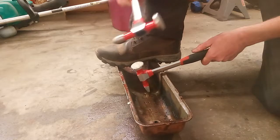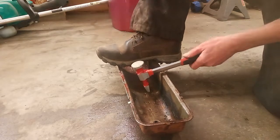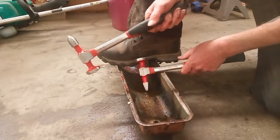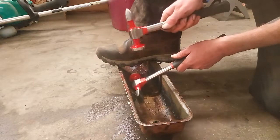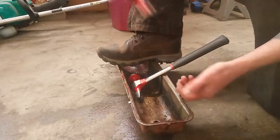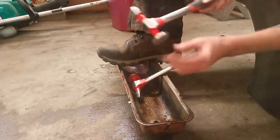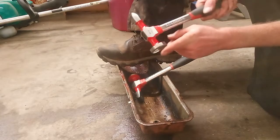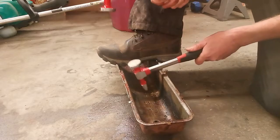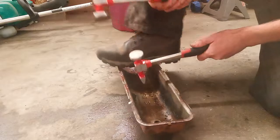Doing quick little taps like that is kind of like a planishing hammer. A very, very slow one. And I keep changing my grips. I pull it clear out here for more power, and then I'll choke up on it. But when you're using these, always try to make it flat. Make it come in flat, not like this, because then you're hitting here at an angle. I hope that's on camera there. And then I use my foot to keep it rocking on that.